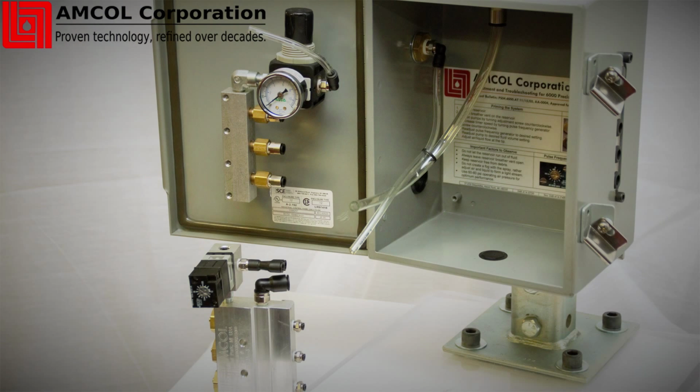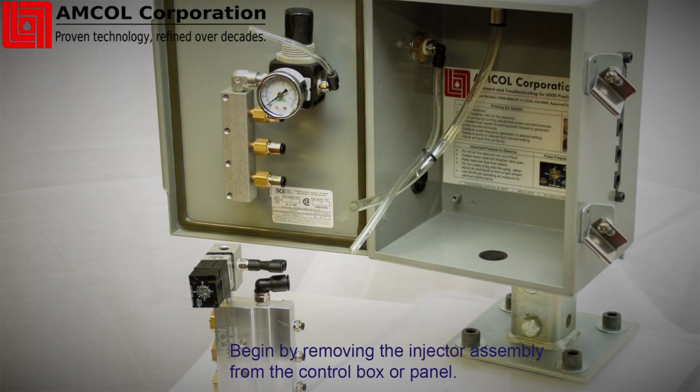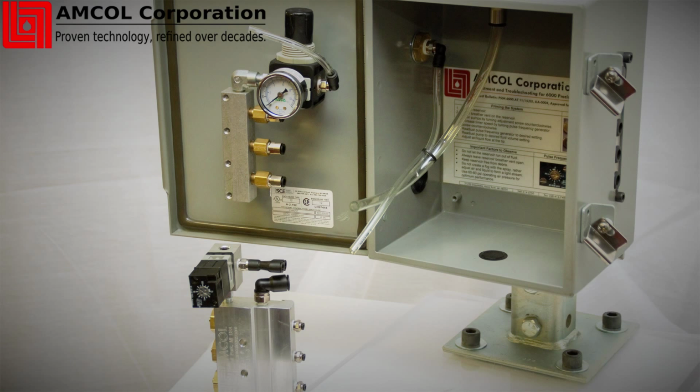You are ready to get started. You will begin by removing the injector assembly from the control box or control panel. Be sure to lock out and tag out the system air source. Then disconnect all liquid and air hoses from the injector assembly. This is done by evenly pushing on the barb release ring on each push to connect fitting, while at the same time pulling on the hose being removed.